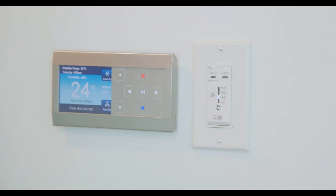Intermittent runs at 20 minutes on, 40 minutes off. Use that when you're away during the day but don't want stale odors when you return. If you're home all the time and want fresh air continuously, set it to low speed — a small, continuous amount of fresh air designed for the size and number of people in your home, with fresh air in and exhaust air out while recovering energy. Medium speed gives a little boost in fresh air quantity for a couple more people or if the house feels stuffy.